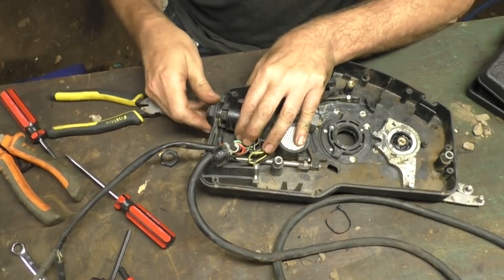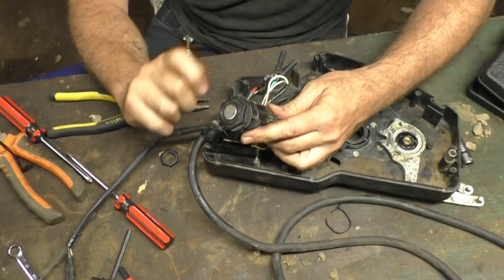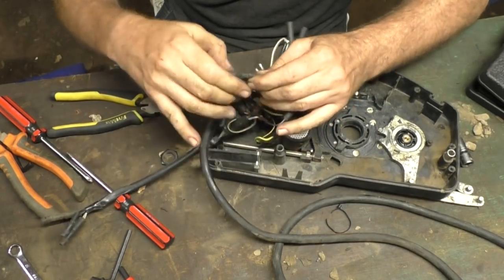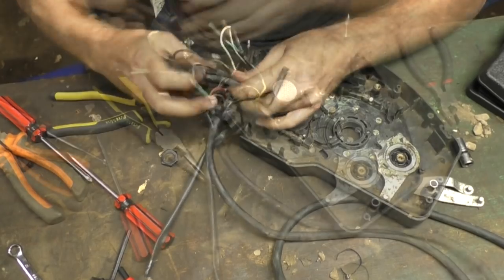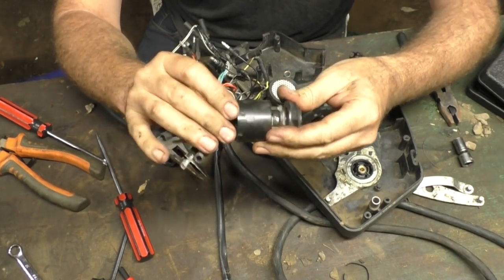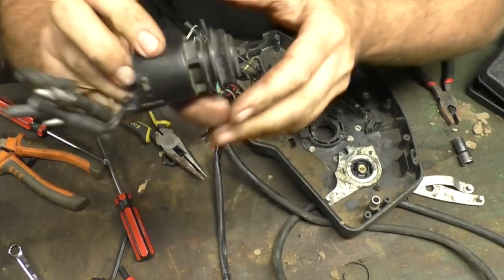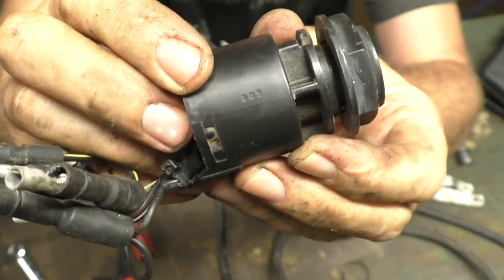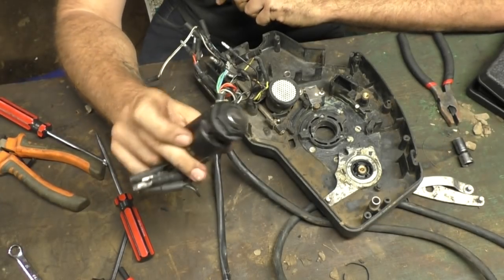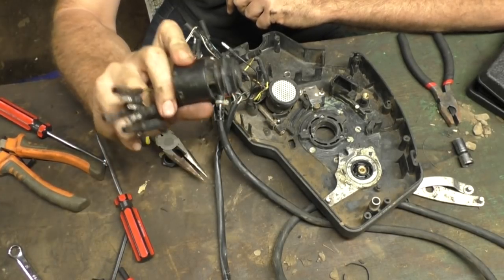A similar idea on this side is our ignition switch, which is a bit more complicated in that we have ignition off, ignition on, then a momentary cranking of the starter motor — so there are a few more connectors for this one. So if you need to change the ignition barrel, or if you lose a key, you'll see on this one there's a little three-digit number. You can use that three-digit number to order a new key for this. I'll probably do that because I actually don't have a key for this forward control, so I can use that number to go and get a new one.